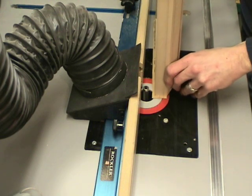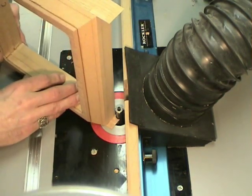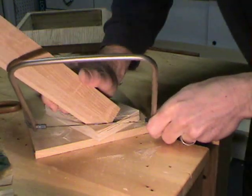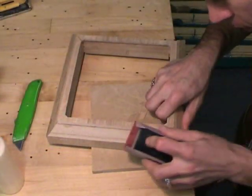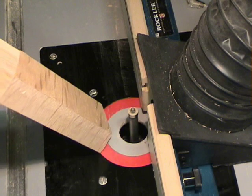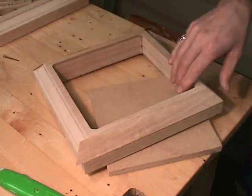I'll show you a few different methods for trimming the veneer flush with the core. One of the easiest ways is to use a bearing guided flush cut bit in the router table — this does quick work of trimming the veneer flush. For the angled portion that overhangs the chamfer, I'll cut it off using a coping saw; a veneer saw would be ideal but a coping saw makes a suitable alternative. I cut the piece close and then clean up the joint using sandpaper, sanding in the direction of the bond so as to not dislodge the veneer from the core. I also used the flush cut bit on the chamfered side — note that I climb cut that because it's all end grain. When there's not a lot of excess to remove, 150 grit sandpaper works nicely for flushing up adjoining surfaces.